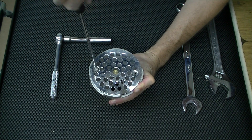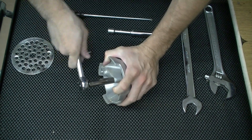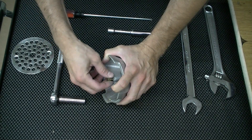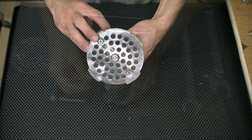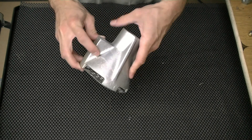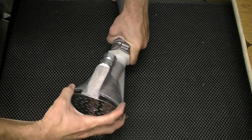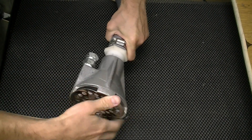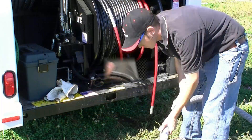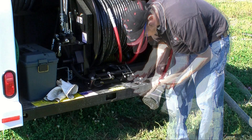For the jetting and suction mode, start by removing the front screen, then remove the brass plug. Install your zero-degree front nozzle and reinstall the screen. Once the pump head is set up, re-attach the 1.5 inch hose. Finally, attach the Venturi pump assembly to your Spartan Jetter.